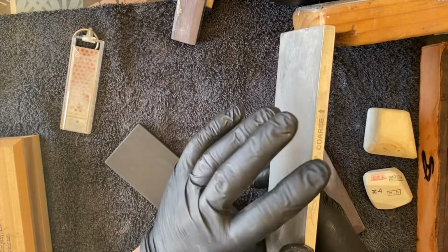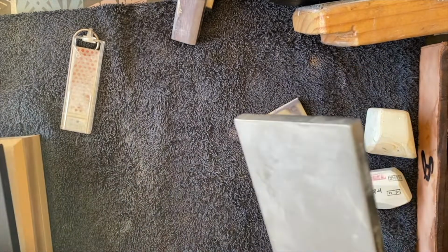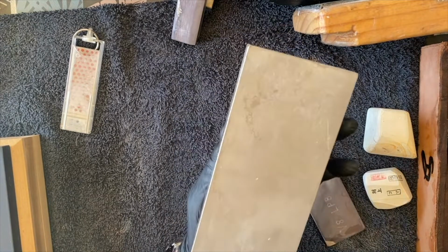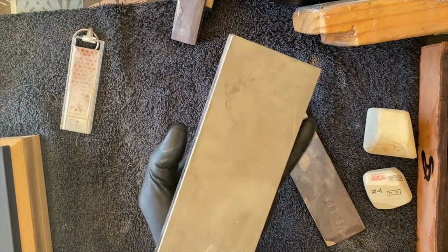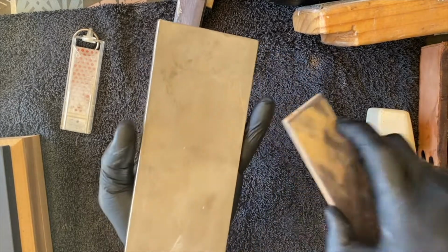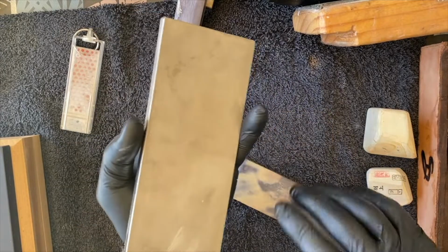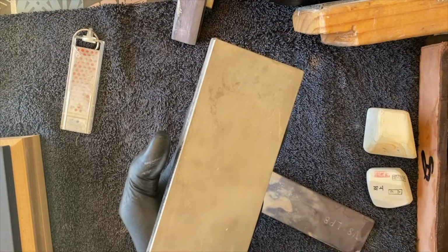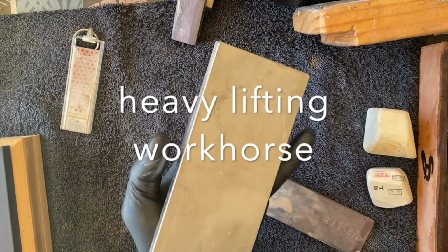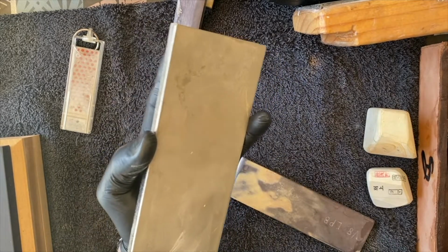I said I got a steel plate. Why? Because when I travel or go and fix my mom's knives or something like that, I need a versatile thing. So I use a coarse plate also to lap my stones. It's always flat, it's mobile, I can take it with me. I can use it to take chips out of knives, out of razors and straight razors, and so forth. So a lapping plate is a good one.